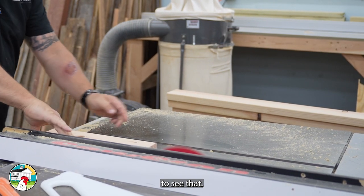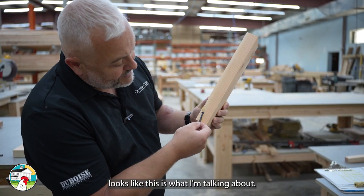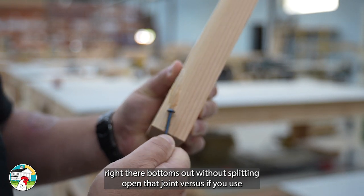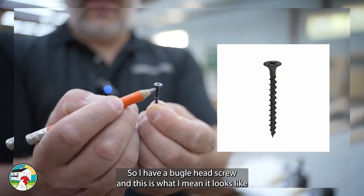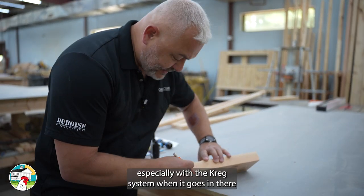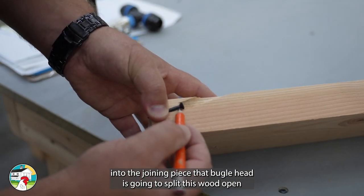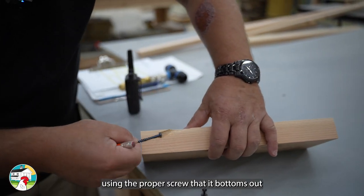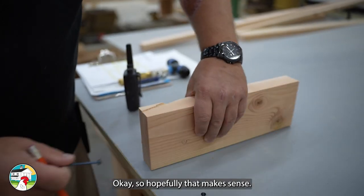We cut away the pocket hole so you can see what I'm talking about. Using a pan head screw, it sandwiches right there, bottoms out without splitting open the joint. Versus a bugle head screw — it looks like the end of a bugle, it's tapered — and with the Kreg system, as the screw drives into the joining piece, that bugle head is going to split the wood open, just like a splitting maul splitting firewood. With the proper pan head screw, all that weight is evenly displaced and it won't split. Don't cheat yourself — use the right screws.